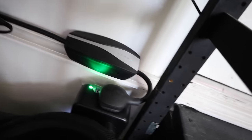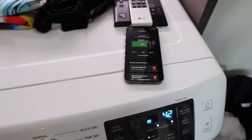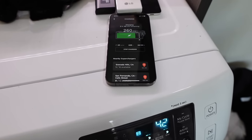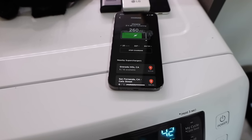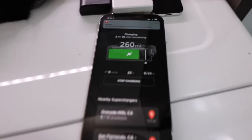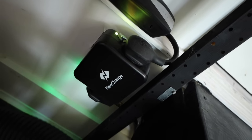The green light on top and the Tesla wall plug is clearly showing it's charging. The bottom has a white light to show that the primary plug is off. Over on the dryer, I'll leave the app open so you can see what's happening. We'll hit start and you'll see the app go from charging to charging interrupted. The dryer will actually start going but it's not producing full heat as the amps are still being dedicated to the car. Once it switches, the dryer is using the full dedicated voltage — usually only takes a second and you'll hear a click on the Neo Charge itself.